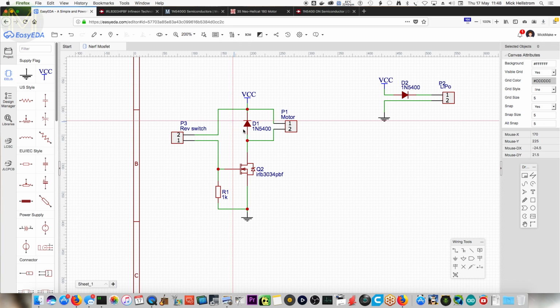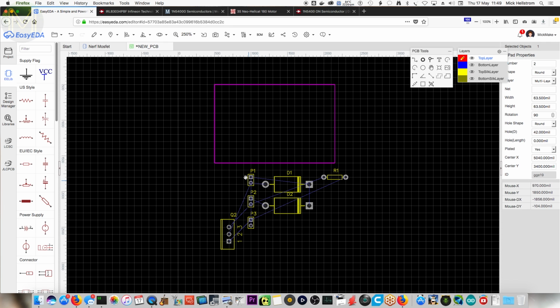So convert to PCB. All right, so this is where you start designing a PCB. Okay. So this is the artistic side of... It's just about making the most out of your real estate, I suppose. This is like solving a puzzle, yeah? Yeah. Because you've got tracks for your PCB. They have to be able to not cross over each other. That's right. And you've got high voltage and low voltage. You want to have certain track widths and things like that.